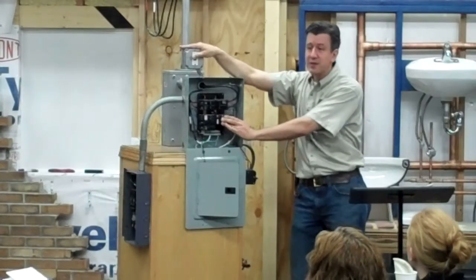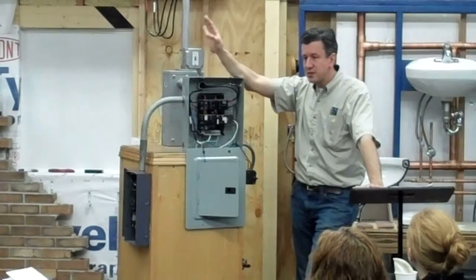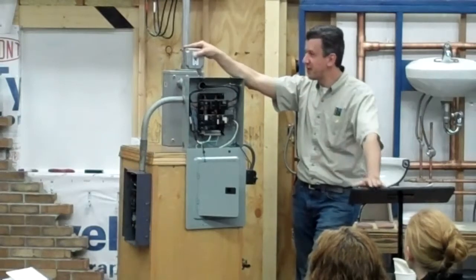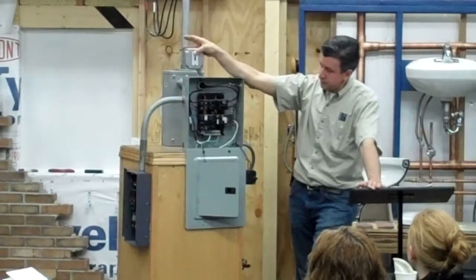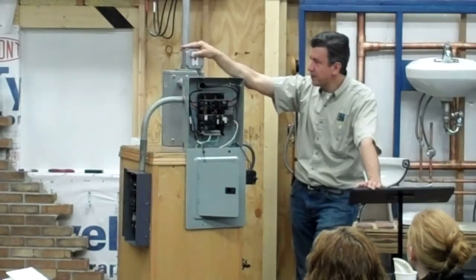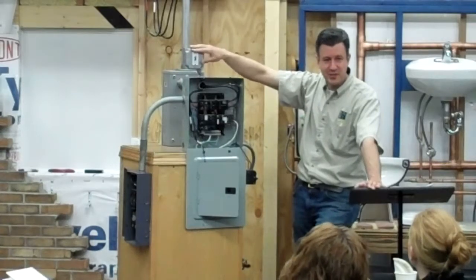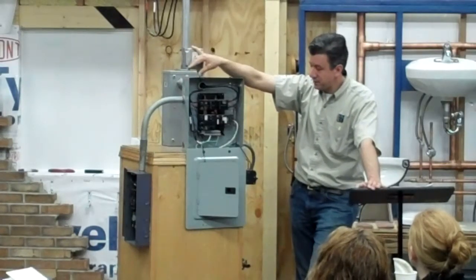It is, but they've expanded it, and they keep on expanding it, and it used to be within 6 feet of a plumbing fixture. Now it's pretty much any counter area in the kitchen. Yeah, because I figured that if you're in the kitchen, your hand can be wet anywhere. It's about $8, $10 an outlet. In general, an electrician will charge you about $40 per outlet to change over outlets for GFCI, maybe $30, $35 for standard outlets. So that's something that they include in their cost.